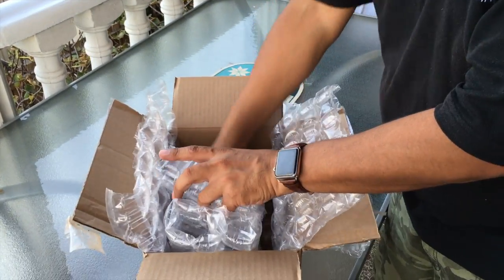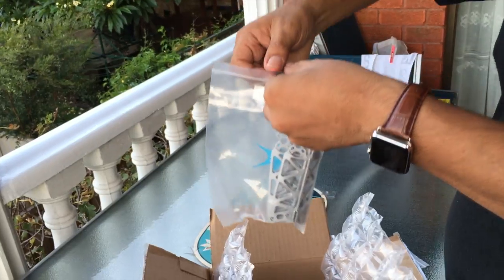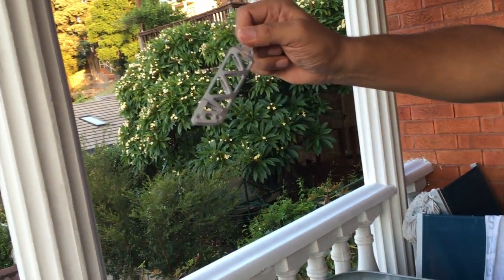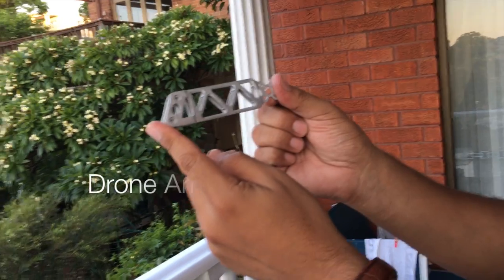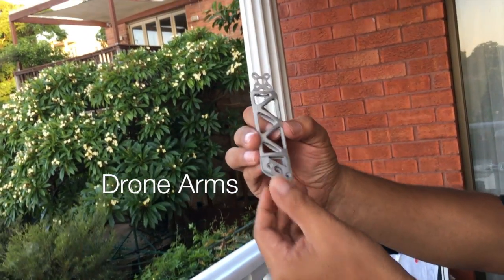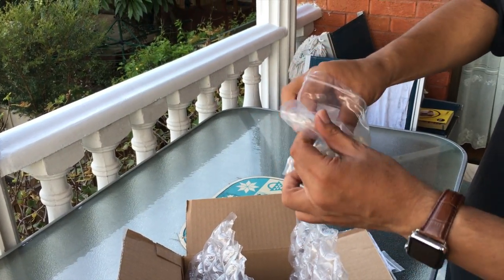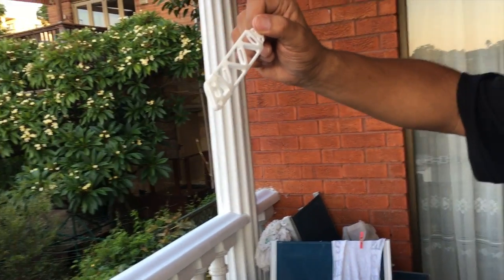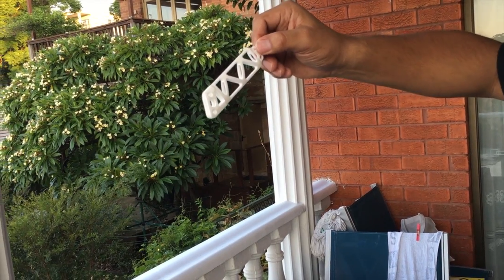Okay, that's just some more of those. And now for the bit that I'm excited about. Just for the record, Shapeways has been doing some pretty amazing metal prints over the years, and it's not the first time we've had a metal print. But what's special about these metal prints is the laser was actually hot enough to melt the metal — aluminium in this case. You have a fused 3D printed block that's comparable to a single milled block of aluminium. And then we've got the same parts but in the normal plastic version. The plastic was basically just a test to see the material differences — of course it will be a lot weaker, about 50% there compared to injection moulded parts.